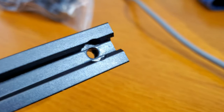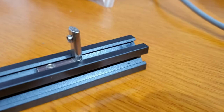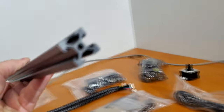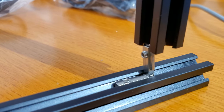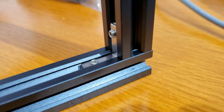It needs to go in with the notch on this side. Here's the hole — this side is machined to accept the screw head, so obviously you want to make sure that side's down. Then the short rail will now drop down. There are screw holes on the bottom of either one, and that will now slide into the rail. Four screws will hold everything together.